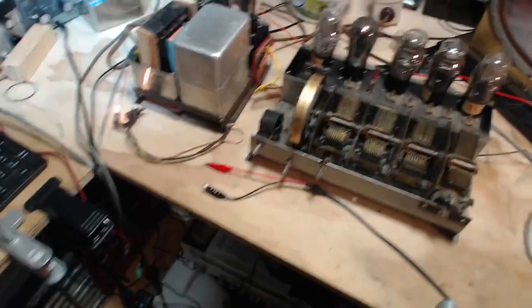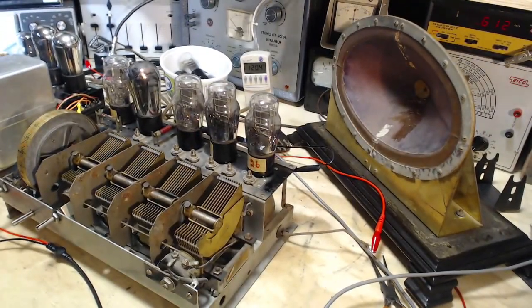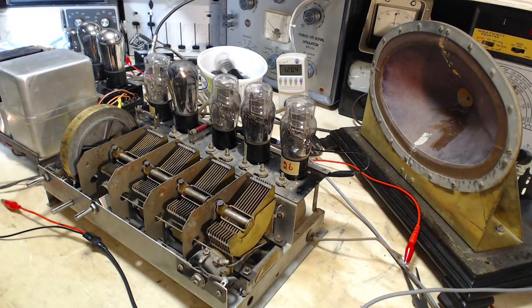Bingo. Hey, if you own an SP600, a Hammarlund SP600, it's a wonderful big old radio, something you'd really want to take care of, watch out for the BFO control. It'll do exactly the same thing. It can be forced past its stop really easily. And the next thing you know, you've spun a coil far enough to rip the wires off it. And many of them have suffered that injury. So, okay. Well, that's kind of neat.